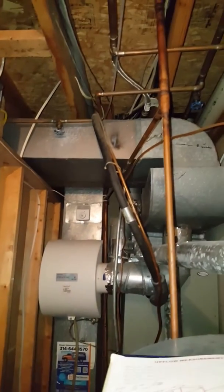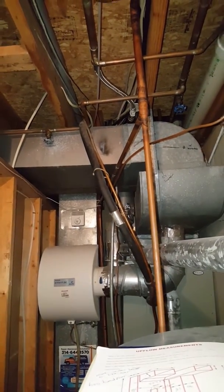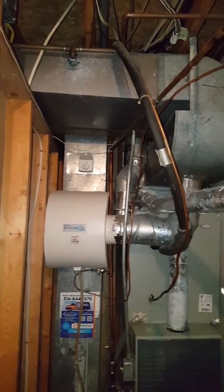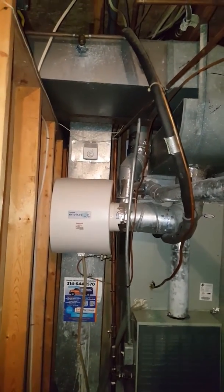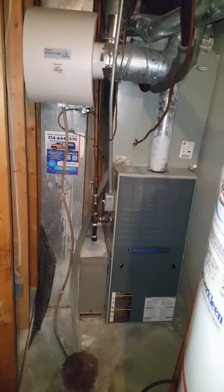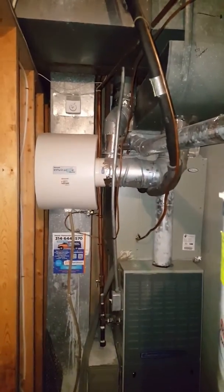Line sets actually have to be new. On the outside — which I'll show you — they've got the suction line dry right up against the house, you can't cut it off. And that's actually leaking water in the ceiling.